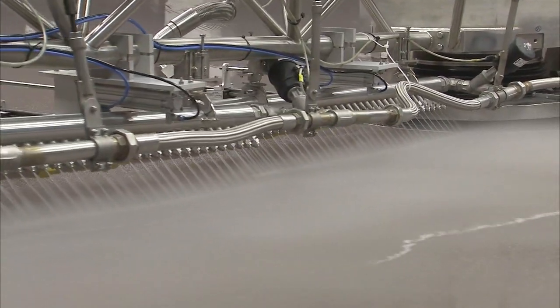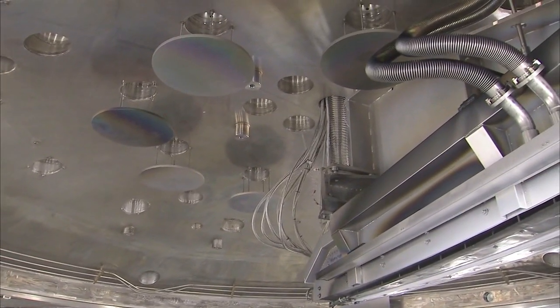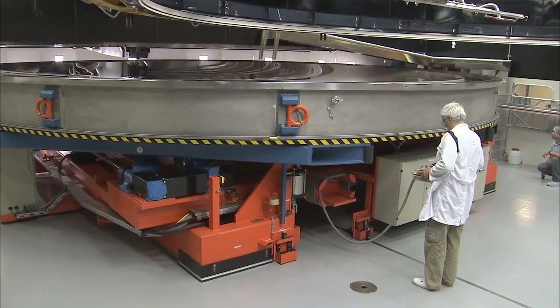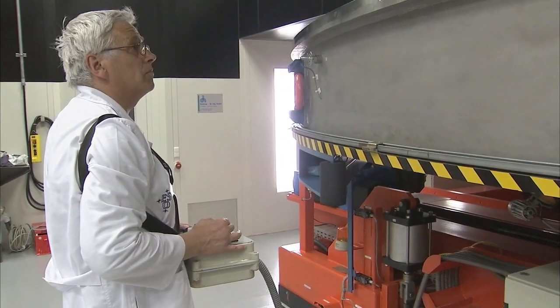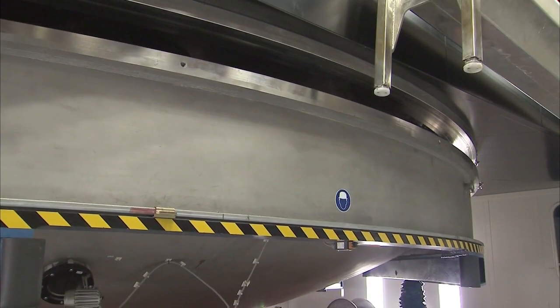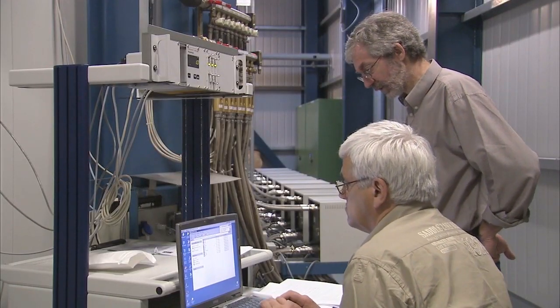Again, the mirror is rinsed intensively to provide as clean a surface as possible. Once done, all the liquid is pumped out and the mirror is ready for the vacuum chamber. The vacuum chamber lies next to the washing unit. The mirror is placed in the chamber immediately after cleaning to avoid contamination with new pollutants. The air is then pumped out to establish a nearly perfect vacuum necessary for recoating. Once the vacuum is established, the recoating can begin.